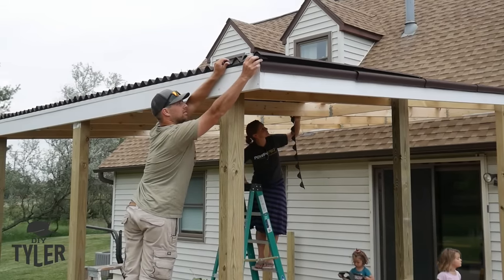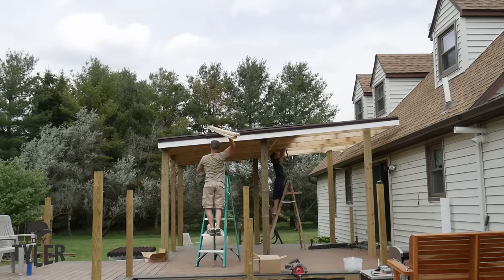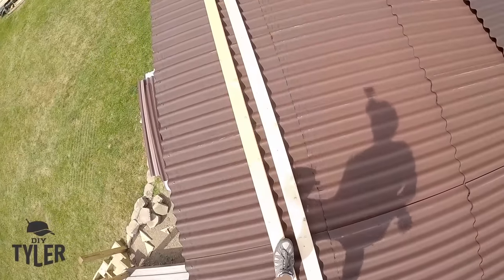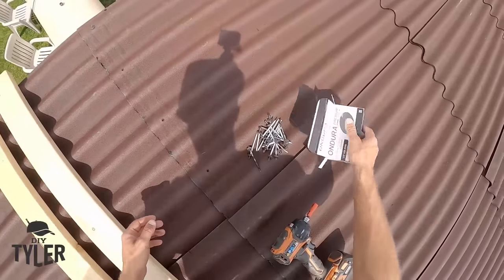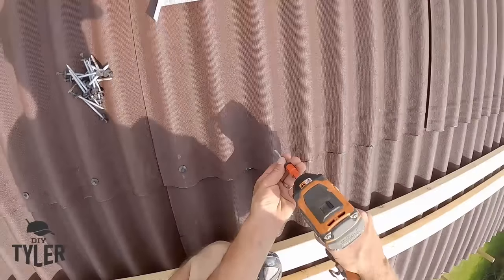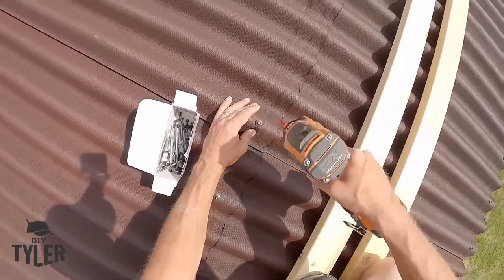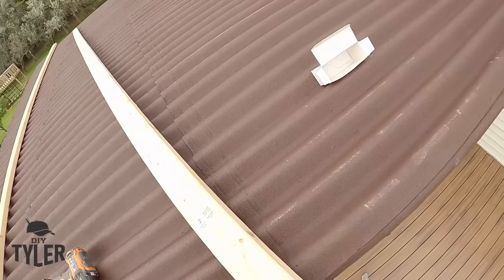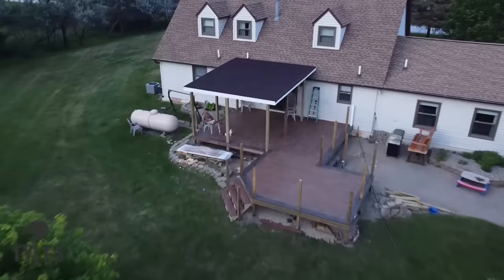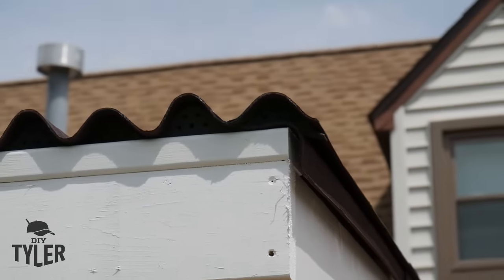We installed the panels with a very heavy overlap because we're at the minimum pitch and wanted to make sure water didn't flow back up into the panel overlaps. We used the Onduline foam closure strips that go in between all the corrugations — they have holes which we fill in later to stop mosquitoes, but on an actual roof you'd want those holes for ventilation. I laid some two-by-fours so I could walk up on the roof and fasten the panels using the Ondura hex-head screws, which match the color of the panel. Very easy compared to shingles — you can find this product at your local Lowe's.